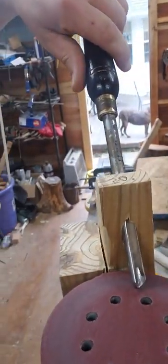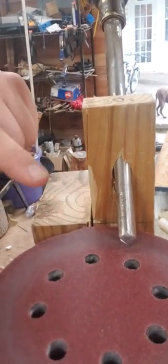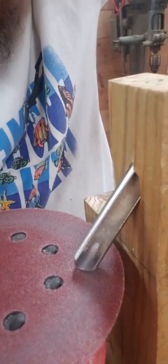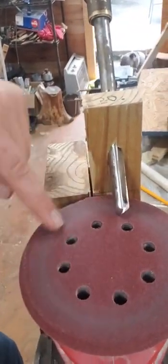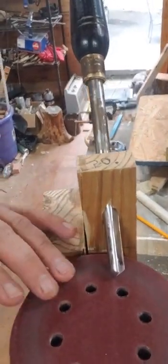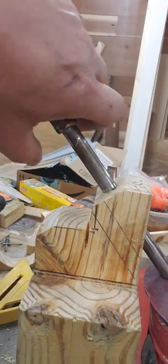Here's the thing: when you twist the chisel this way, you can't see how far you're digging into the sandpaper. It only takes a little too much and it digs in, and since this is spinning, you've just torn a big spot out of the sweet spot of your sandpaper — which ruins that sheet. It's not crazy expensive, but it's inconvenient and you'll feel like a goober, especially if somebody's watching.